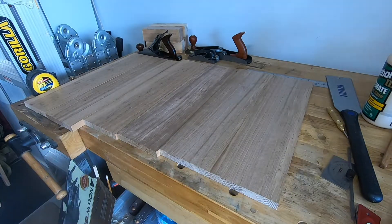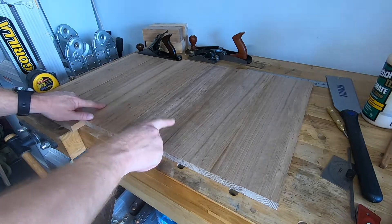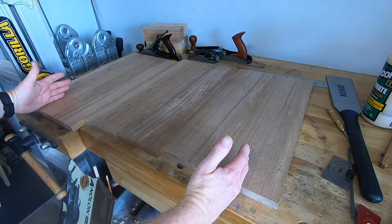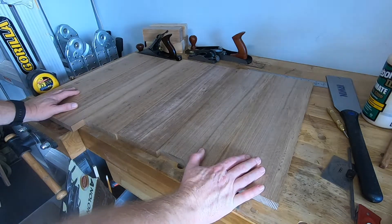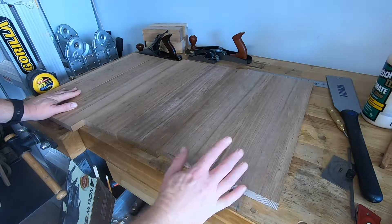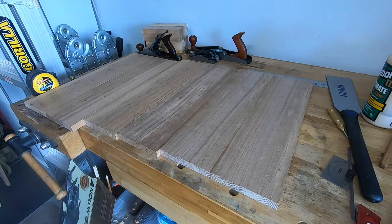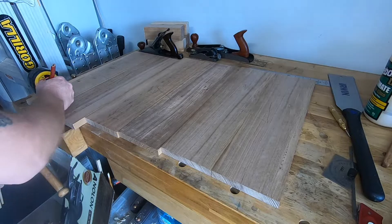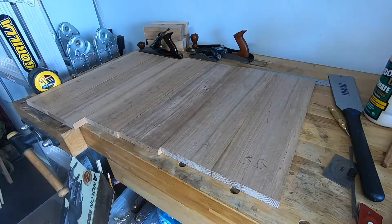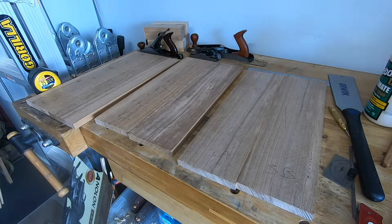I think that's going to be the layup of the panels. This also makes it easier in that I can just shape the rabbets here and here, put them back together. It's going to be kind of like this — a wide middle board and a slightly narrower but similar top and bottom board. That definitely will work. While it's like this I'm going to grab a pencil, make some marks, and label them one, two, three so I remember the order. That makes the glue-up easier — just glue two panels, two panels, two panels. Much simpler to keep them flat and straight.